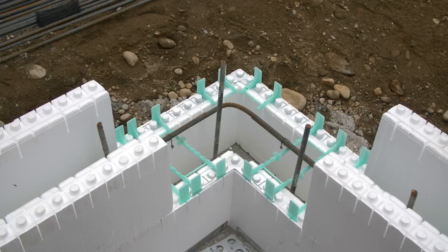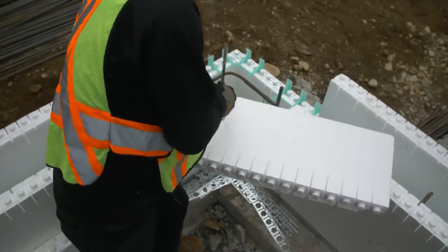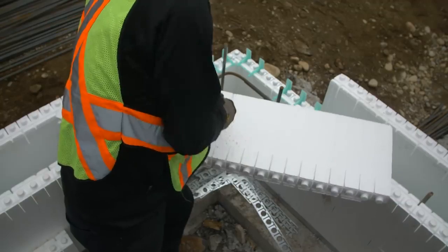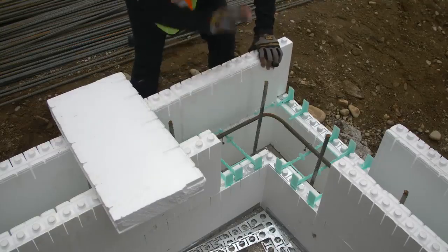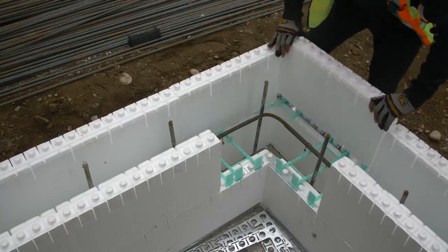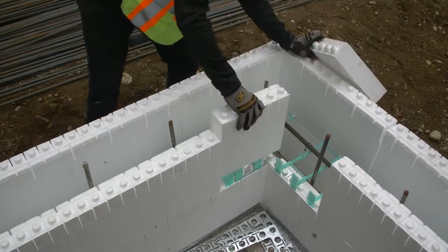Measure the spaces remaining to the corners, keeping the lap pattern identical to the bottom row. The outside panels will always be 24 inches with factory ends in the corner. The inside panels will vary in length depending on the wall cavity size, but will both be the same length if lapped identically to the outside panels.